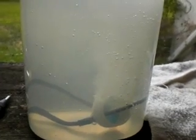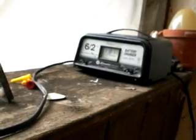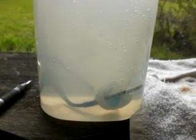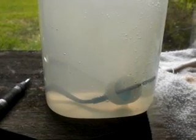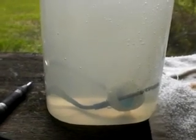On my solution, I've got too much sodium hydroxide added, I believe. I think what I would like to do is go with another plate configuration with more screws, but reduce the amount of solution. Notice that this tank will warm up pretty quick. At most I'm drawing about 4 amps. One thing about this last configuration is that I can leave it on the high settings and it won't trip out my thermal, so I'm actually drawing less current than before. I filtered the solution through a coffee filter to get all the solids out and cleaned the tank, so I have a relatively clean starting point.